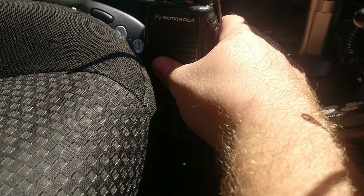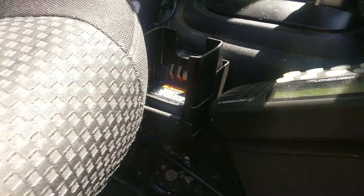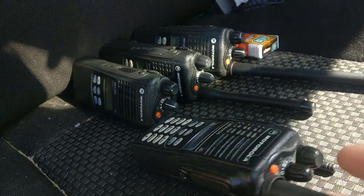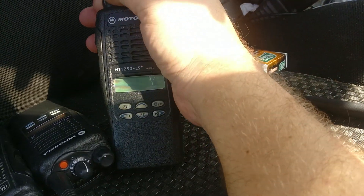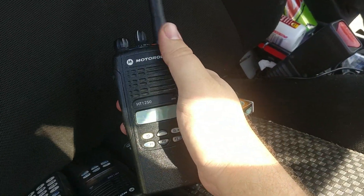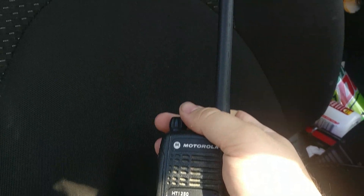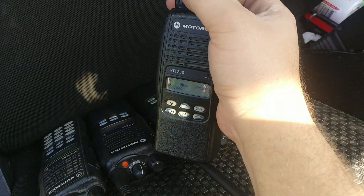In preparation for a cross-banding switch, I have installed one of these Impress dock chargers that I can use to charge any of my HT Pro Series radios, so I can switch back and forth between 2 meters to 440, 440 to 900, etc. Here I have the MTX 9250 — a 900 megahertz radio modified for amateur operation. Here we have an HT1250 for 70 centimeter operation, which needed no modification. Here we have an HT1250 LS Plus with modified filters and software for the 220 amateur radio band. And finally, another modified HT1250 converted from low band into the 6 meter amateur radio band. All of these can be charged directly in this Impress dock charger, and eventually I'll be able to cross-band any of the mobile rigs to one of these portables, making this charger an invaluable resource.